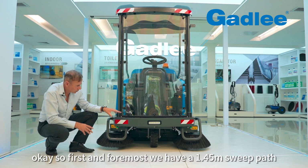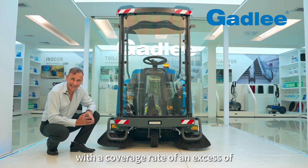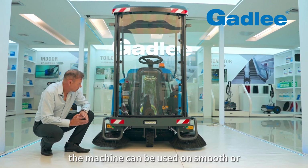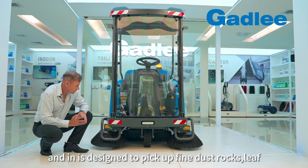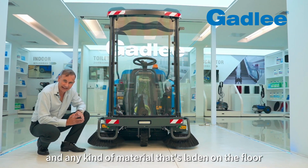Okay, so first and foremost we have a 1.45 metre sweep path with a coverage rate of in excess of 11,000 square metres per hour. The machine can be used on smooth or heavily corrugated floors and it is designed to pick up fine dust, rocks, leaf and any kind of material that's laden on the floor.